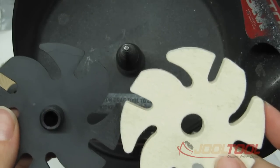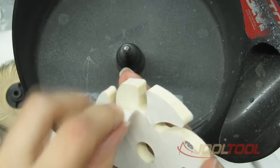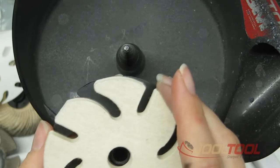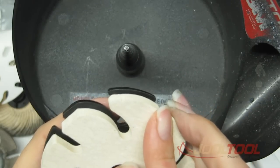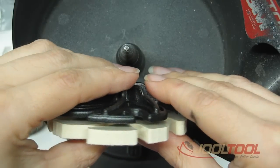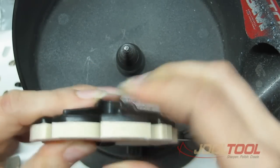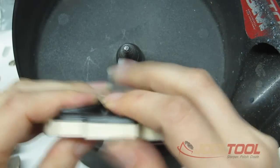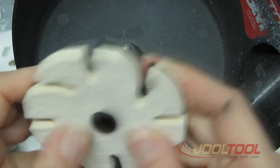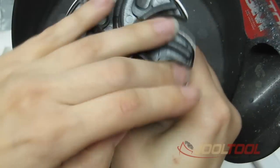Here I'll show you how to mount the ninja felt wheel on the ninja back pad. You simply remove the back sticker off of the brace and place it on the ninja disc. Don't press it all the way down yet — align the ninja disc fins, and once you've established all of them to be centric, press firmly onto every single fin to make sure the PSA adhesive adheres to every single fin of the ninja disc.